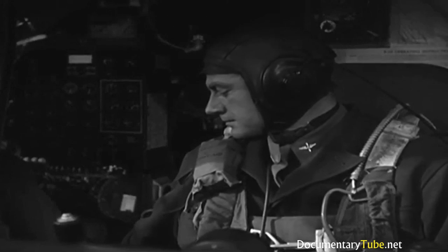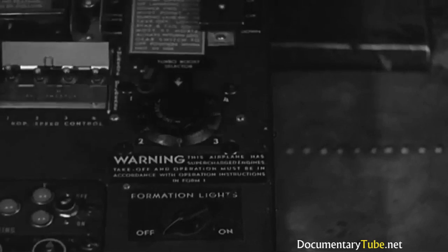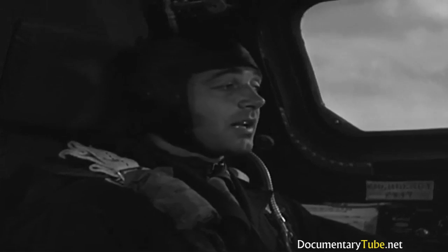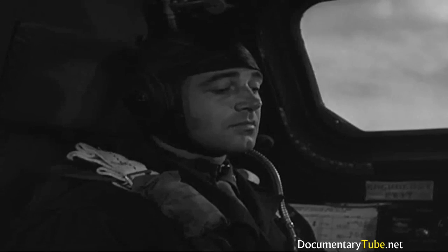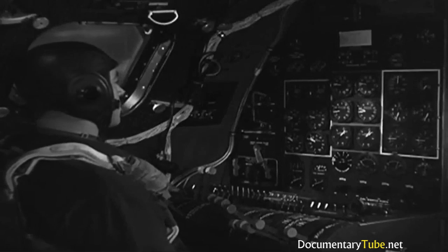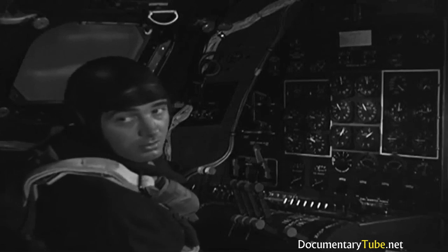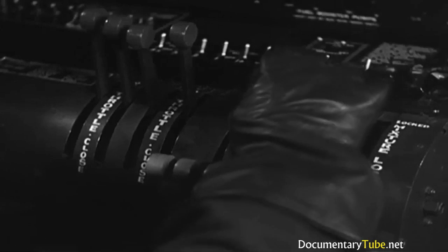Yes, the pilot has leveled off and is now setting up cruising conditions. 2,100 RPM and 31 inches manifold pressure. That's cruising power. You can see it yourself. Now I get busy. Turbos are off, so intercooler flaps ought to be closed. Then the mixture controls to auto lean. Tell the pilot, and do it.